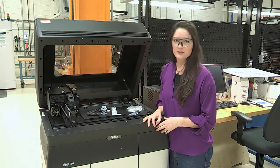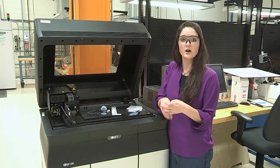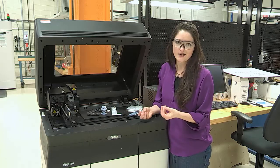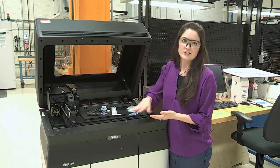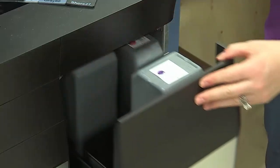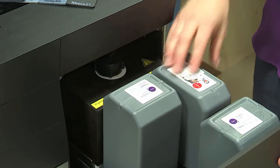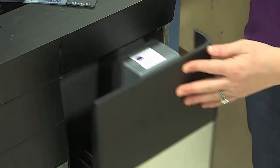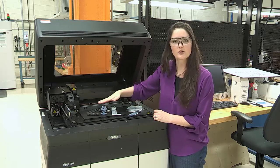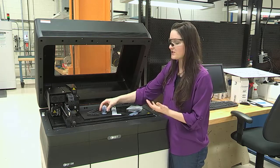This is our second technology, called PolyJet. The first one was FDM — extruding hot plastic through a nozzle. With PolyJet, we're depositing a photopolymer or liquid resin with an inkjet nozzle into the shape of each layer of the part. This liquid resin comes in a jug, gets sucked into a pipe, and then gets piped out through the inkjet nozzle and sprayed into layers. We spray a layer of polymer, then cure it with UV light, spray another layer, cure it with UV light — spraying and curing until we build up these three-dimensional parts.